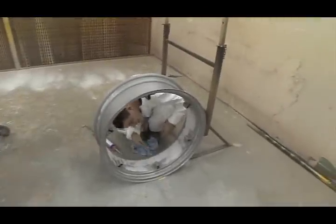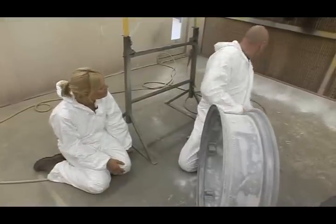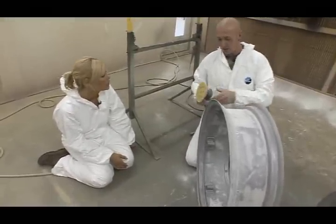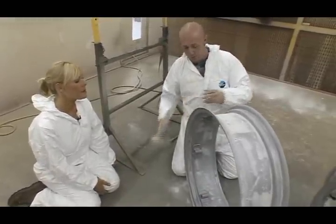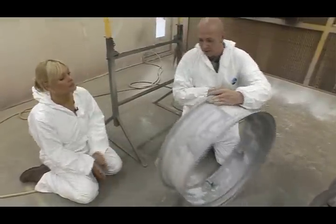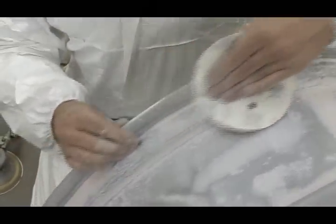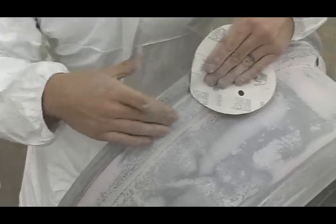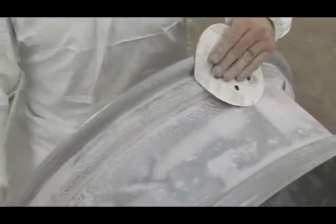How do you work with them? Sanding by hand, how come you're doing that and not with a machine? Well, the palm sander, you can see it's a large flat surface. For one, you can't get it in all these edges here. So basically, you get yourself a sheet of sandpaper. The curves here on the actual edge of the wheel, you can be rubbing in this curve here. You can also put your finger there and it'll rub this curve down all the way around. You're killing all three curves in one swoop. Plus you're getting a natural feel for the metal too, and it keeps it original.